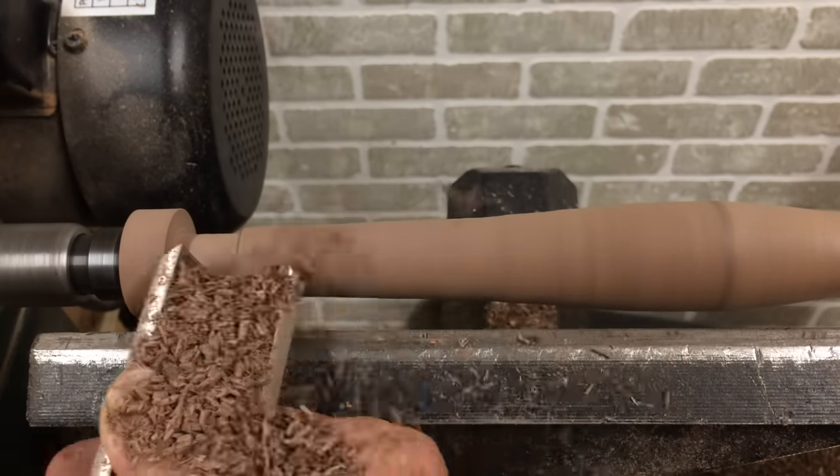I can take this out and set it aside, and I need to set my new piece in here - this is where the T-bevel acts as a guide. I've got a 5/8 inch Forstner bit here, I'm going to mark right in the middle, and then pivot it on that angle to get it lined up. Okay, so it's started. Now we can cut these to length - I just need to line up the pattern here and mark them at each end. I'll set this back in my little cradle here to make it easier for cutting, and then just trim it with the dovetail saw.